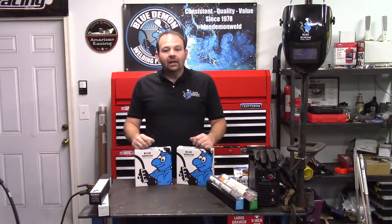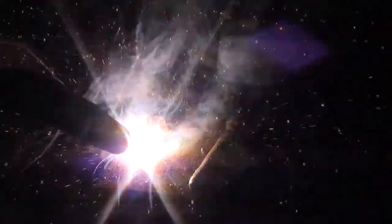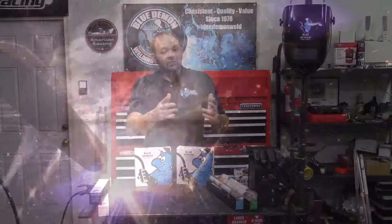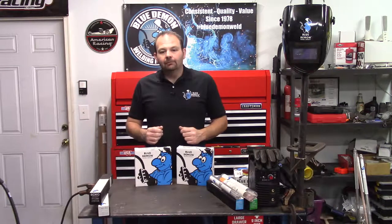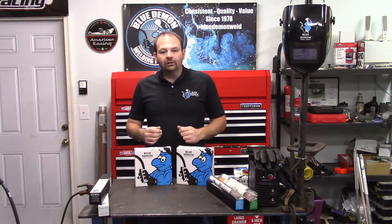Hard facing, also known as hard surfacing, is the process of adding harder or tougher weld metals to new or used parts to extend or prolong their useful life. Often, parts are replaced prematurely, not because they're broken, but because they're severely worn. Examples of this could be dredge parts or earth-moving equipment. Hard facing will bring life back to these worn parts.